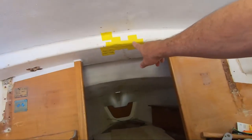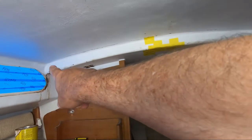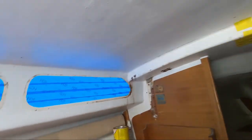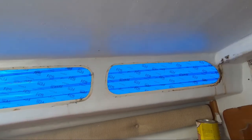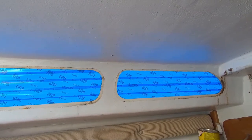So we've got left the topside of this area. I can now start my fiberglass work cleaning these messes up. I'll sand around the windows so that as I start my primer, I can prime the inside and prime the outside. Get the paint covered up there and then get the windows back in place and get rid of my blue tape. That's a big load off my mind — I was sweating those chain plates. I'll give you a quick look up top.